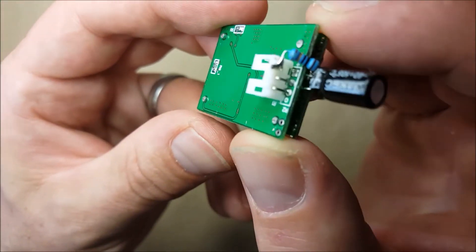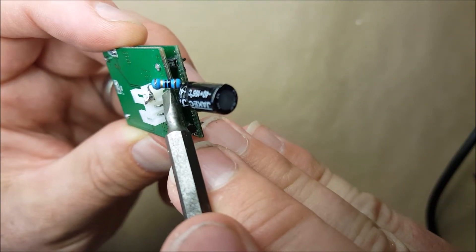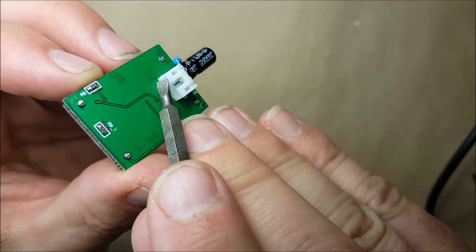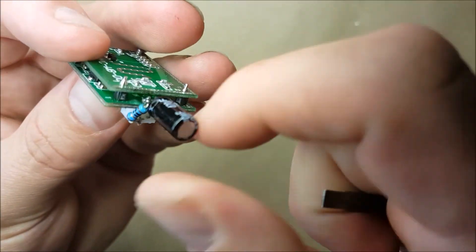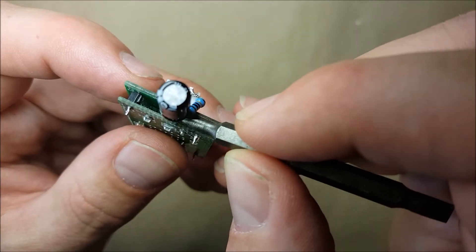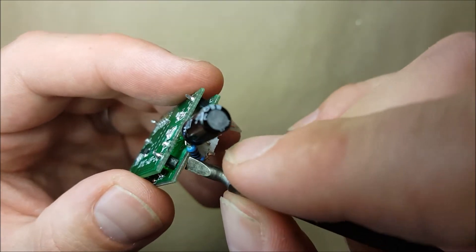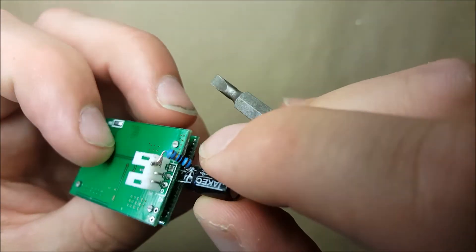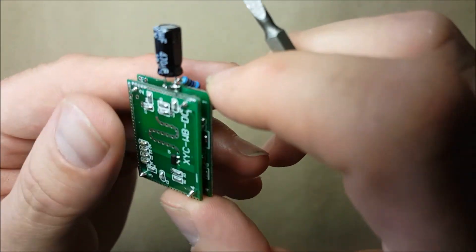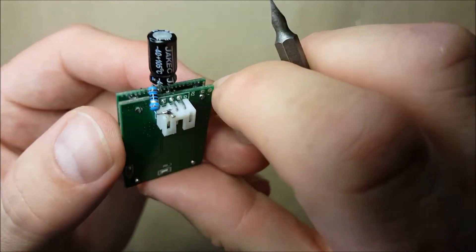Hopefully I can show you this if the camera will focus in. The resistor is now sitting in series — the power is going to come in via the power pin, go through that resistor, which then joins up on the underside with the remainder of that pin. The capacitor positive side goes to the power in, negative side goes to the middle pin which is ground. These are just tied together. It's quite a fiddly job, but that should now give me some filtering on the power line.